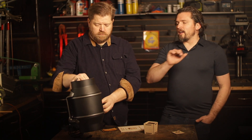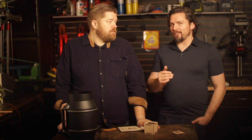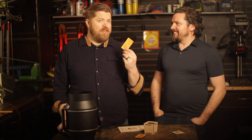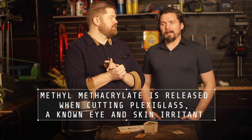The inline fan leads perfectly into our next tip: you absolutely must have adequate ventilation. This is a laser burning through materials, and anytime you burn anything you're going to have smoke and off-gassing. We recently made leather Salt Lake City business cards — burning leather doesn't smell great. If you're cutting something like acrylic, it has some real nasty stuff when it burns. You don't want that in your house or your lungs. So be aware of the ventilation.